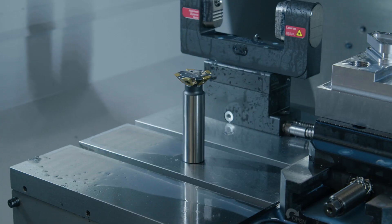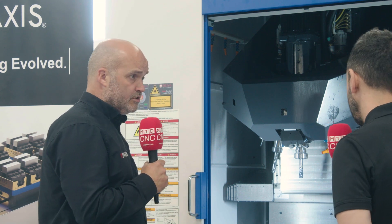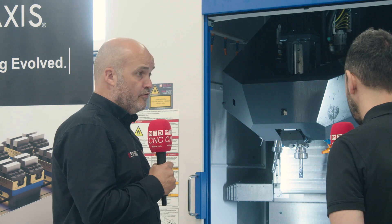Very, very important point actually. The dovetail will clamp and give you additional clamping force without deforming the part. There are a lot of systems out there which will slightly deform the parts — this takes that out, takes the pressure out of the vice and off the lead screw as well. It's probably one of the most solid joints, the dovetail joint, which is a very old-fashioned technology but has been incorporated in our Fifth Axis vices for many years.